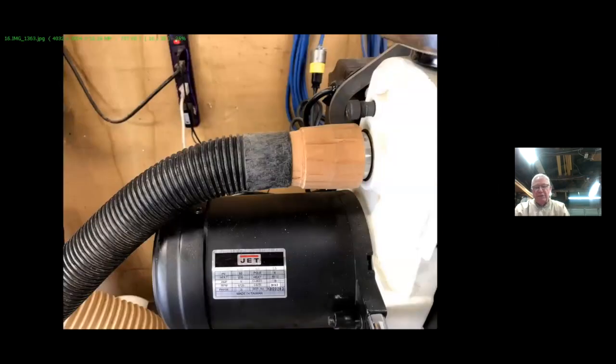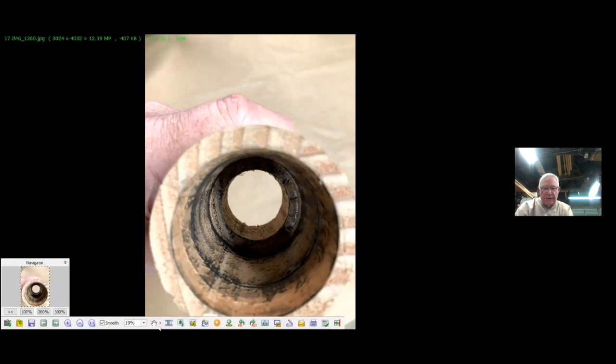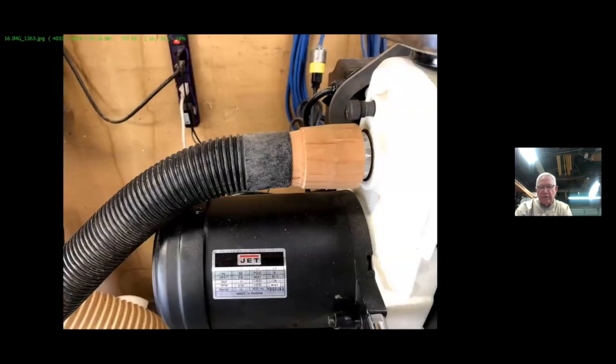So the two things that you need to make this work, the first is a spindle adapter. That's what I'm going to call it. But it's just a piece of wood here that hooks up. Now, this is a little hard to get the perspective, but you're looking at the big end of it right down the bore. And the chuck goes right in here, and it rides against this lip in here. The hand wheel, sorry, the hand wheel rides right against this. And then, of course, on the other side of it, the hose goes over a tapered fitting there. So that's really all. And we'll talk about all of this stuff and what the significance of leaks is and how tight it should be and all of that stuff as we get along with it.